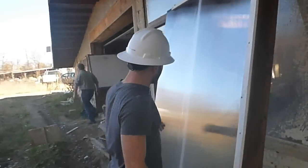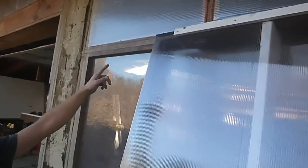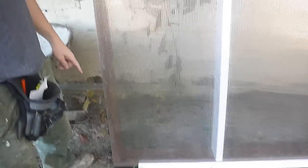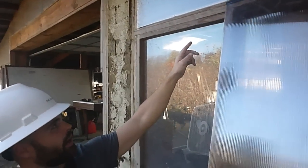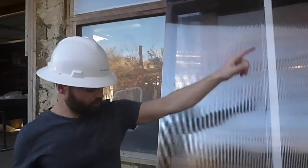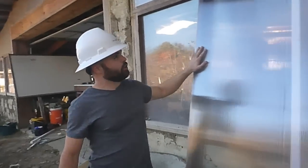Follow up with your polycarbonate, which as you can see, we sealed the top and bottom with construction tape so that no moisture can get in there. It also helps with insulation a little bit by reducing air flow. And then the entire outside of it was trimmed out — this is how the polycarbonate is attached to the frame — with 1x6.